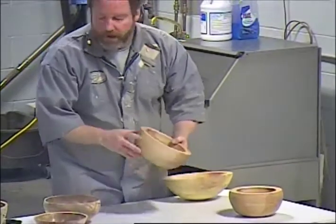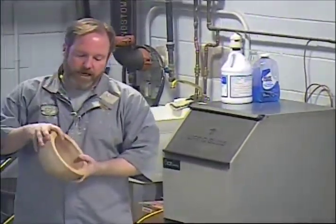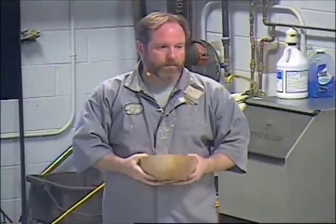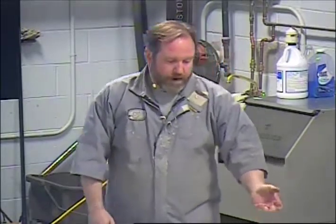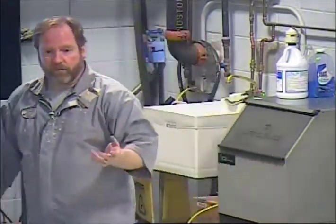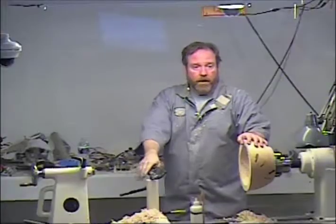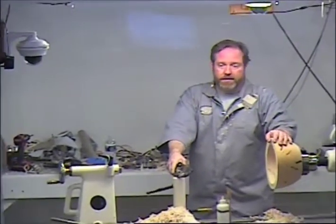These two, I followed this procedure, which is just sealing the end grain, and then I put them in a brown paper bag with some of the wet wood chips. Other options are seal it 100%, brown bag, wet chips, for nearly a guarantee that it's going to work. Or you can get it online from all your craft supplies and places like that.